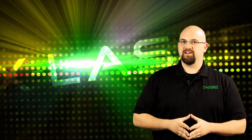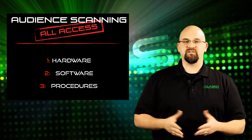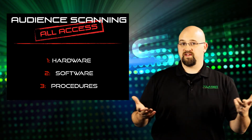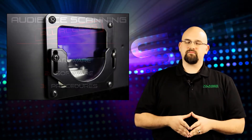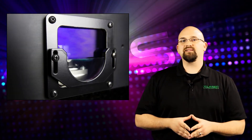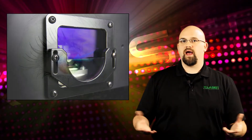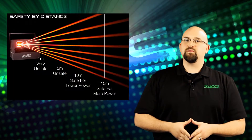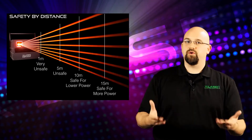So how is this even possible? To keep the laser's irradiance low and create spectacularly immersive experiences, we use three different sets of tools: hardware, software, and procedures for setup and testing. On the hardware side we're doing three very key things. First, we're using a combination of optics including a patented scan safety lens from Pangolin to make the beam so big by the time it hits the audience area that it can't all fit into your eye. If the beam is too big to fit into your eye, we only have to account for the very small portion that can fit, meaning we've dramatically reduced the irradiance. This part of the system works on distance — the greater the distance, the bigger the beam. The bigger the beam gets, the safer it becomes and the more power you can safely use.